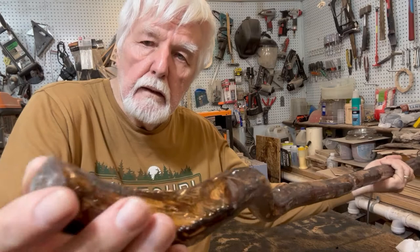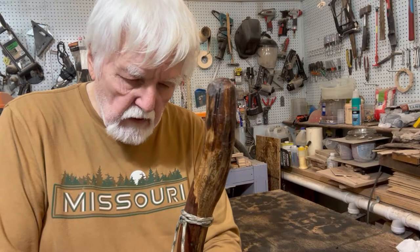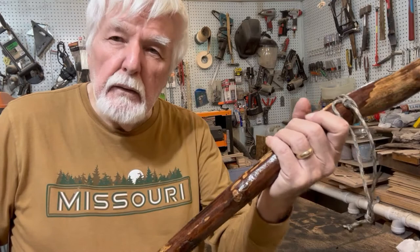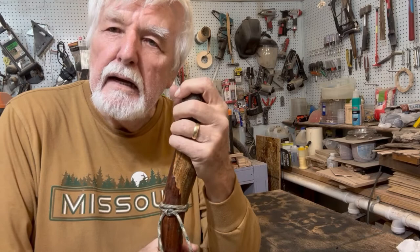We just whittled a little bit on each end, and for all practical purposes we completed a walking stick from start to finish: taking the bark off in part one, preparing it for the finish, and in one of the later parts we showed you how to do the epoxy coating on the outside, which fills any small cracks and waterproofs the stick so it'll last for many years.